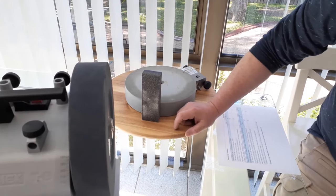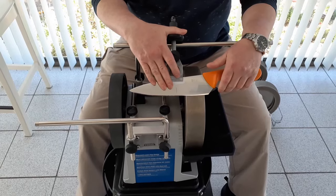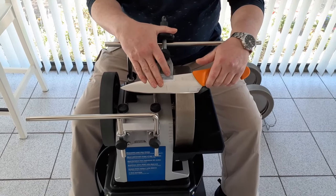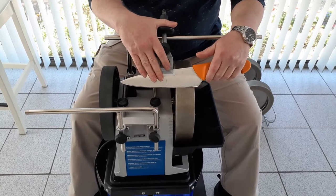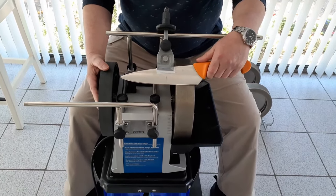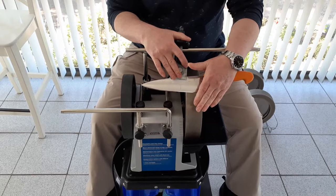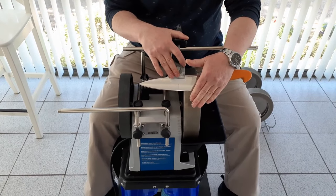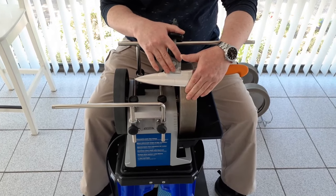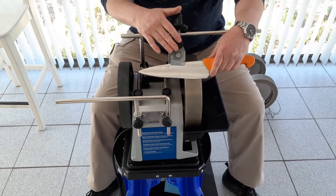To keep the video short, I cannot show you all the sharpening combinations in actual sharpening. Let us model a situation when you are after fast sharpening and time is important. This is the combination number one or two. With the composite wheel applied instead of the fine grinding wheel, you can sharpen faster. In a situation like this, I will be using a single grinding wheel, either the Tormek Black SB wheel, trued to coarse, or the CBN wheel grit 160 and the composite honing wheel. Let's do it now, step by step.